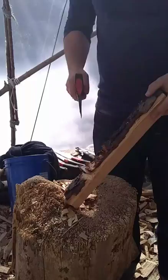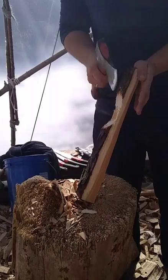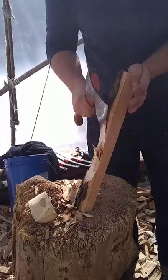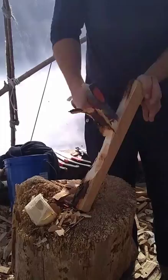I find it advantageous to make a stop cut because it allows me to split down the wood of the handle, which on larger spoons is particularly advantageous in terms of the amount of time that I save. Now, it is a point of failure for me. It's one of the areas where I'm most likely to screw it up by oversawing the stop cut or by not paying attention to the grain and splitting down to the bowl. So, yeah, you will screw it up more. That being said, for me, where I'm trying to be as efficient in my timing as possible, it is a big savings on timing,